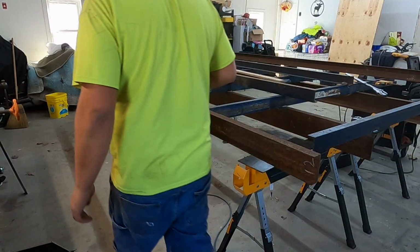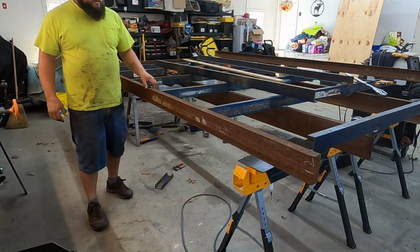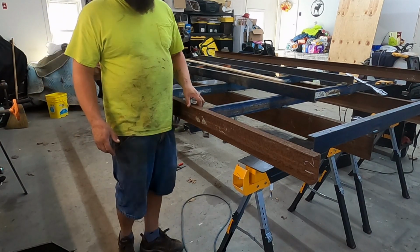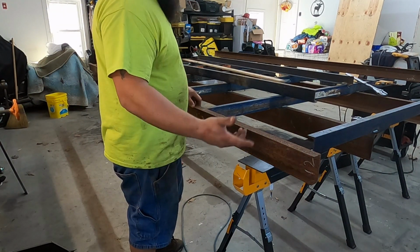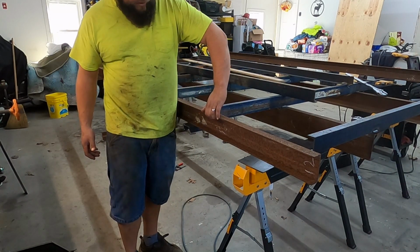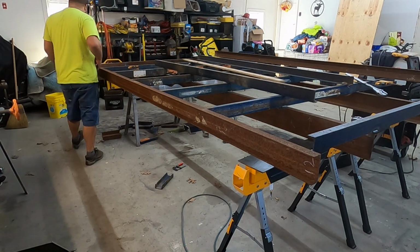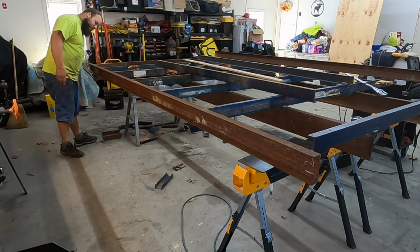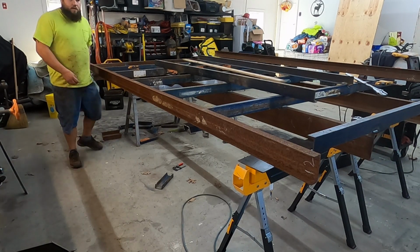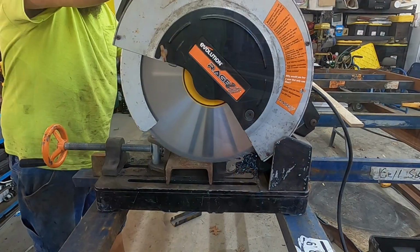I had some 4-inch here already paid for. It gives me an inch down to the top of the 3-inch, obviously. So if I put like 1-inch oak boards on this, it'd be good enough. I won't have the lip that goes over the top. I'll turn these out, but that gives me a place to hook chains and stuff. So yeah, I think that'll work. I'll get all that marked out for grinding and cut to length and get to welding.